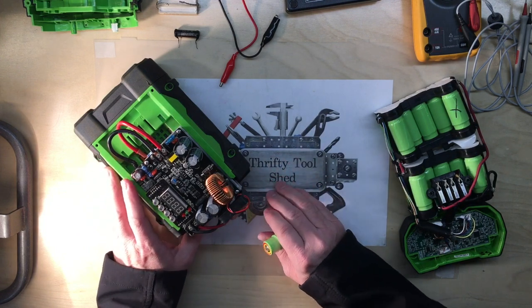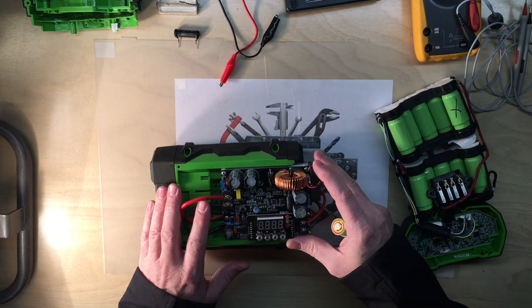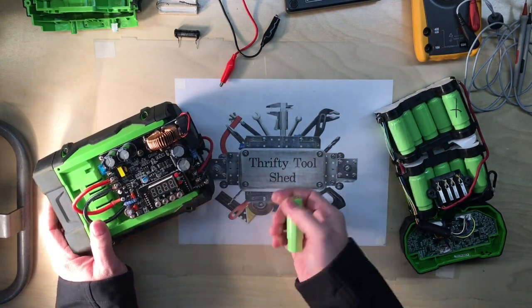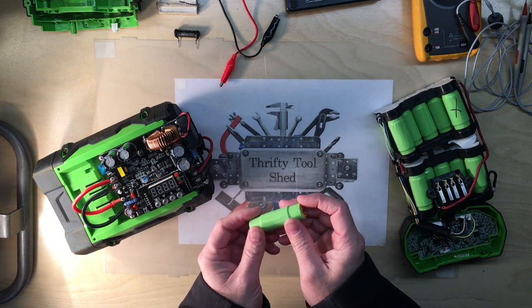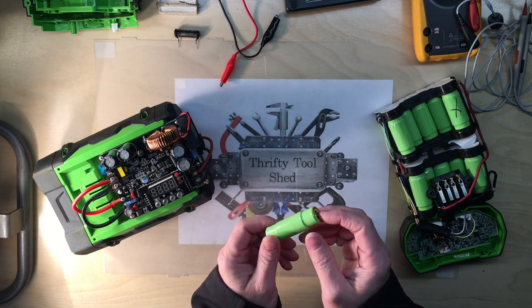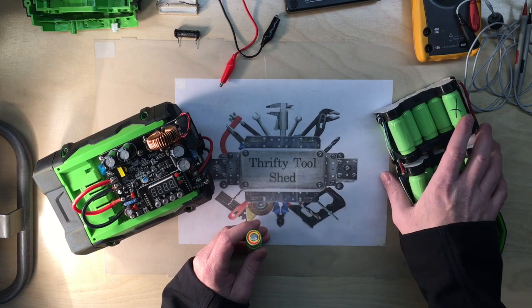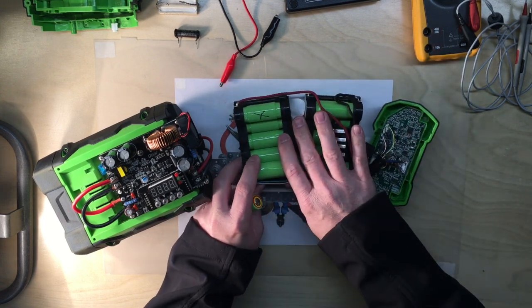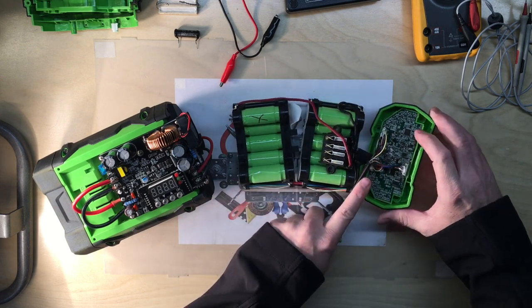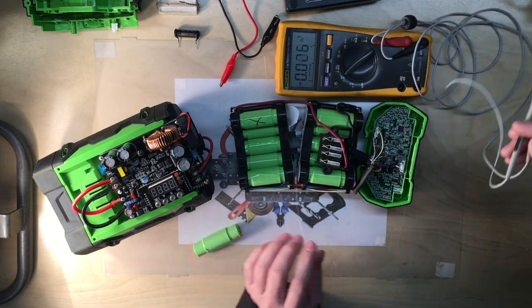We'll try to do a quick one on how I done it — I didn't go into a lot of detail in the previous video because it had gotten so long. I have here a fully charged repair pack from a previous video. The drop power supply can be set to whatever voltage is needed, really even down to one cell. This pack has a B14 that is a bad cell, and I've taken all the potting off the board so I can easily check every cell.